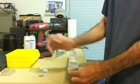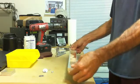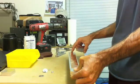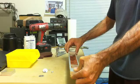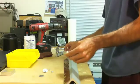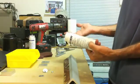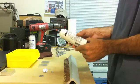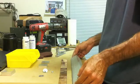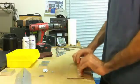I'll take a nice beefy piece of aluminum, bolt those down, and I'll have a nice flat strap area. I can also run another piece from here to my ground point by the window and clamp it back down, completing my whole ground system. I'll be using antioxidant between the copper and aluminum — I doubt it'll oxidize much in here, but it's good practice. Now I need to clean everything up with some scotch brite.